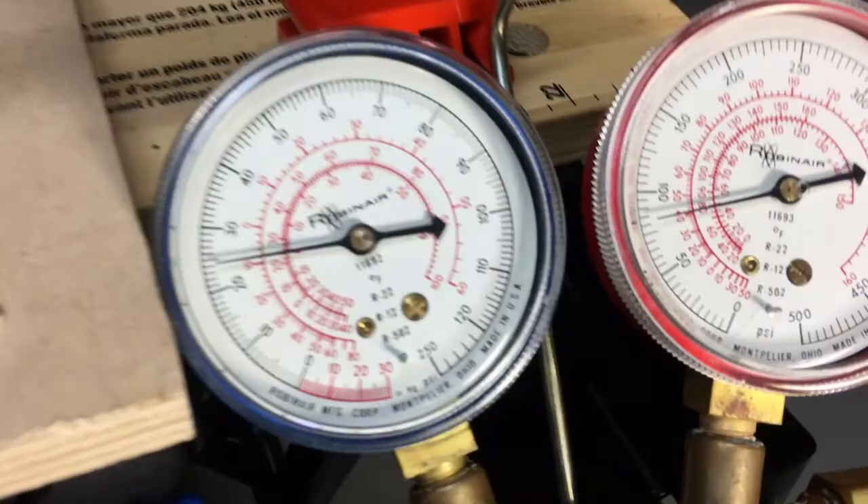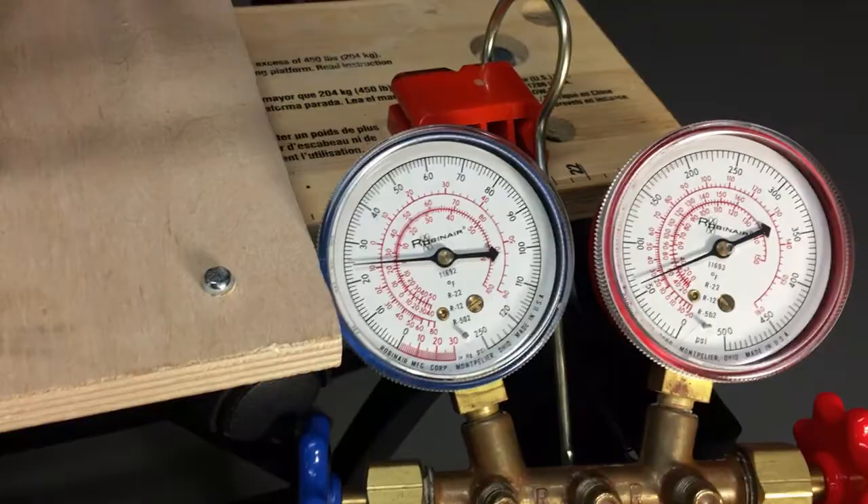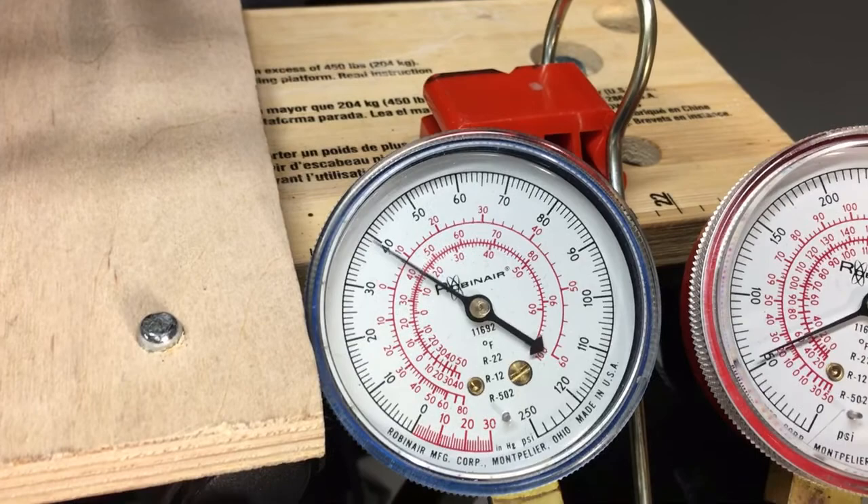All right, I've got the little line capped off — it's a two-handed affair. We've got the fitting off, which is sealed now because this is a check valve fitting, and basically a line here full of liquid. You can see we're still hanging on the high side pressure, so I'm going to open the high side valve, which is going to dump whatever liquid is in that line. It will share with whatever is going to the can, and it will also show up on the low side once we give it a little more juice. It goes pretty fast.